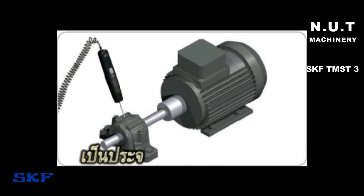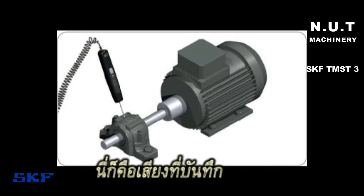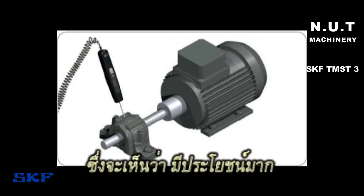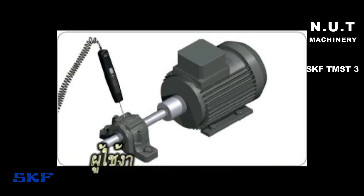Practice is required to be able to distinguish the different noises made by the bearings, and here the recordings made with the aid of the SKF electronic stethoscope will prove to be a great help. If recordings are made regularly, they can be compared to see whether a new element has appeared in the noise